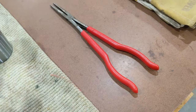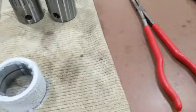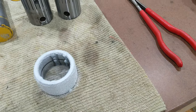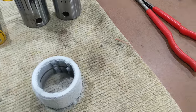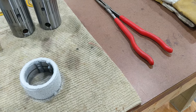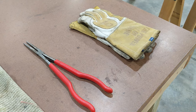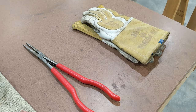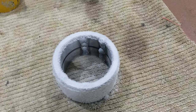You may have seen my bare hand holding the pliers in the first video — I was just holding the camera for that segment. In practice, always wear a face shield, safety glasses, and heavy gloves with no exposed skin when working with liquid nitrogen. When placing the bushing into the nitrogen, gently set it in — don't drop it.